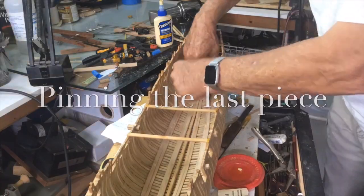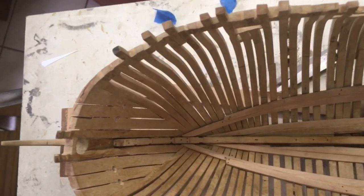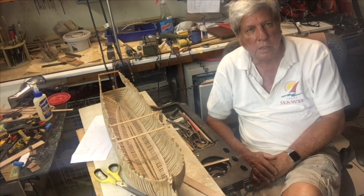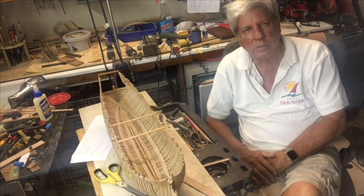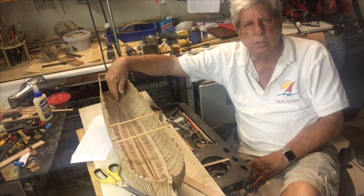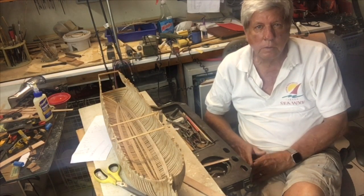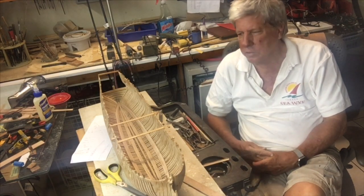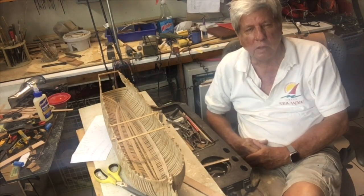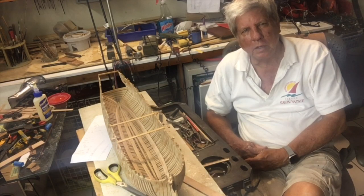All that was left to do was put the remaining three dowels in, clean it up, and wait for it to dry. This brings us to the end of the middle floor head strake. It has been much easier than strake 6, and I assume strake 8 is going to be perhaps the easiest of them all. The only major challenge I still have concern with is the stern and the height that the floor heads come onto the sternson — I'm not sure if I got that wrong. It will be interesting to hear Greg's comments when he has a chance to see the video. But I'm not unhappy, and it doesn't impact on anything I'm going to do above it. All of this is going to be covered because the entire model is going to be planked, so you're not going to see any of this — it's really just for my gratification.